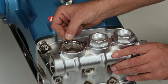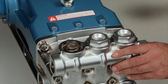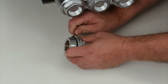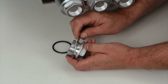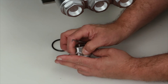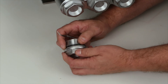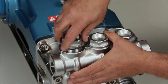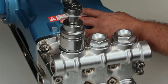Reinstall the washer, followed by the coil spring. Before reinstalling the valve plug, using a small screwdriver or pick, replace the o-ring and backup ring provided in the valve kit. Install the new backup ring, followed by the o-ring. Before reinstalling, apply liquid gasket to the o-ring and backup ring on the valve plug. Use a 41 millimeter hex wrench to tighten the valve plug. When tightening, ensure that the backup ring stays in place. Then torque to specification.